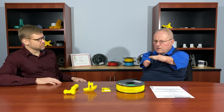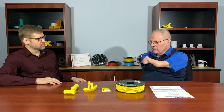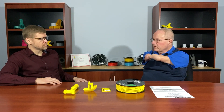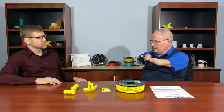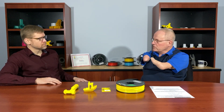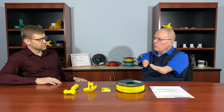What kind of specific properties does this material offer compared to some of the other materials? Well, one of the things that it does better than regular PLA is elongation at break — that's one of the chemical terms we talk about in polymers. It's got a little bit more forgiveness in terms of being able to bend, and that's kind of what that means. The other thing is that it's got a superior melt flow, which means it comes out of your nozzle much better. We try to target a certain range for melt flow in both our resins and our final product. Those are the two things I would say make it unique.